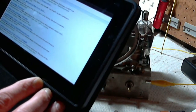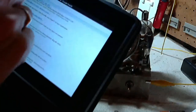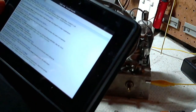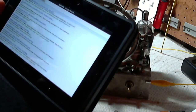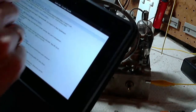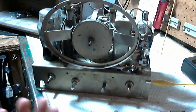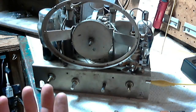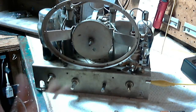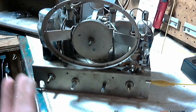6.3 volt, 0.25 amp, so it takes a fairly high current. But it's a 6.3 volt according to this. Just reading what others are saying about it. So it's kind of strange to say 6 to 8 volts. Every bulb has a rating, like, let's say a 6 volt rating. It should give you its stated life. In this case, the 8 should give you the stated life. And you can run any light on lower voltage. So if it's an 8 volt bulb you can run it on 6. That's not exactly big news, is it?